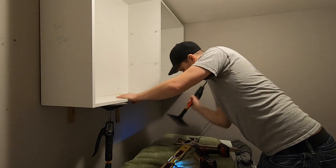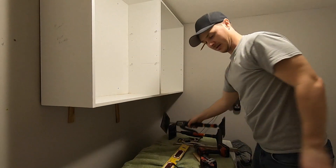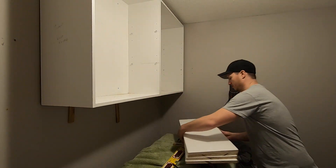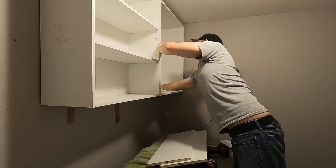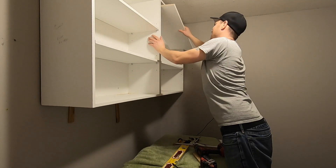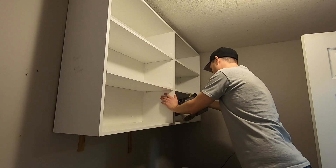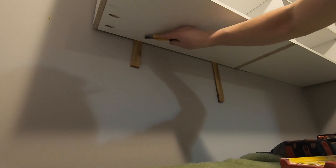If you have the problem at the top or you need to shim the top, you're going to have to go from the side. I can get a shim under here for this one as well, and then I should be able to just screw these tops in and we're good to go. Take out my jacks — and that's it. I'm just going to vacuum them out, throw in the shelves, and we can fill them up with junk. Make sure you cut these guys out — you seem to always forget that. Thanks for watching. If you like this video, please hit like and subscribe, and I'll try to get some new ones out as soon as I can. We're going to keep renovating this laundry room until my wife's happy.